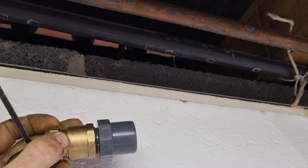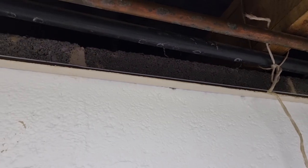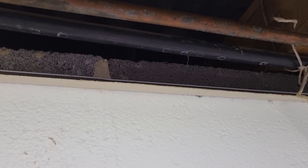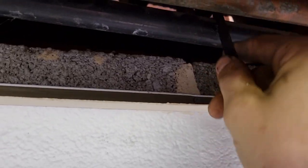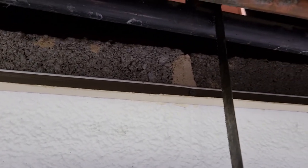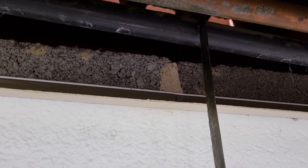It's recommended to use a wheel cutter on these but I can't really get one in, so I'm just going to use a fine blade in my hacksaw and just cut it there. Getting my hacksaw blade in — I need to hold against myself. The pipe is sucking in now, so that's a good sign.